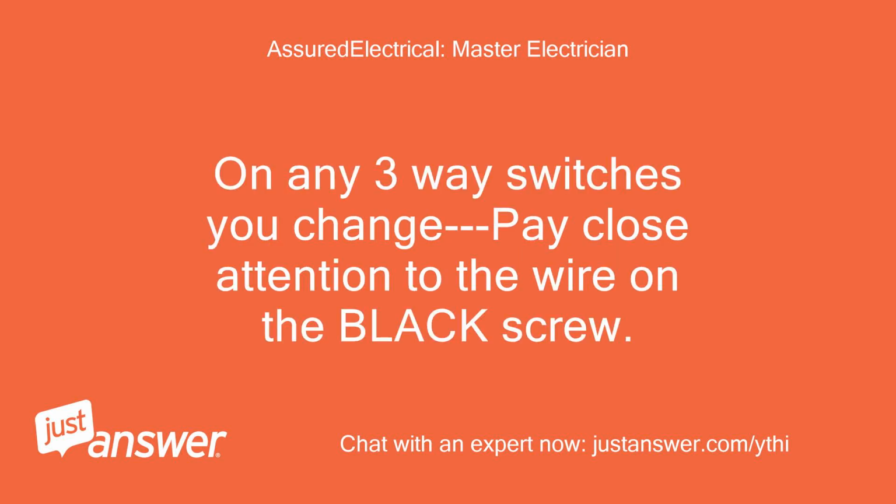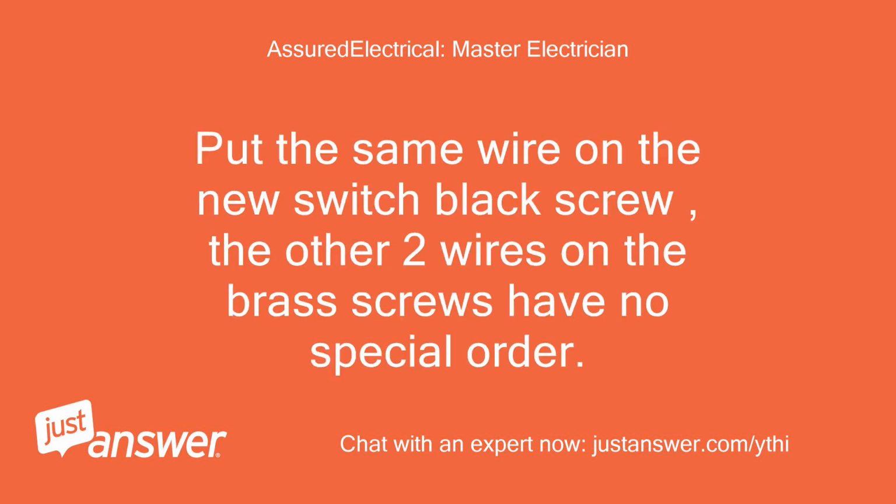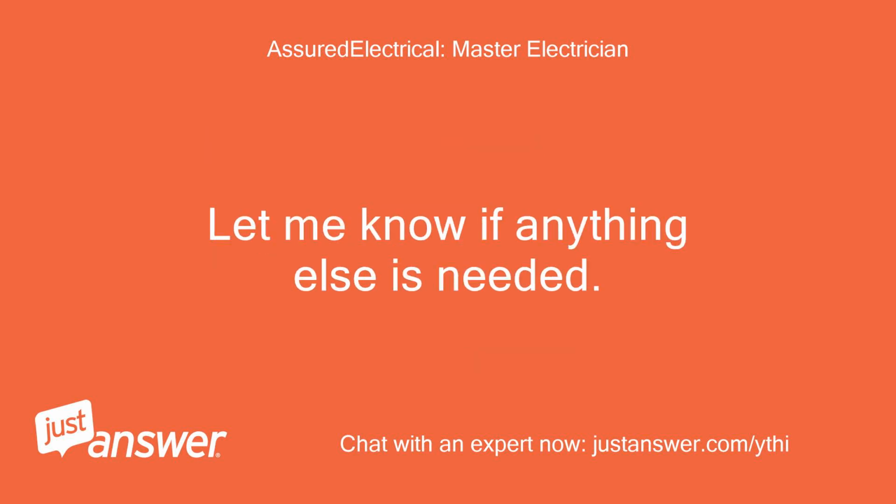On any 3-way switches you change, pay close attention to the wire on the black screw. Put the same wire on the new switch black screw, the other 2 wires on the brass screws have no special order. Let me know if anything else is needed.